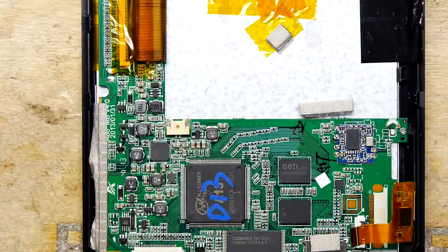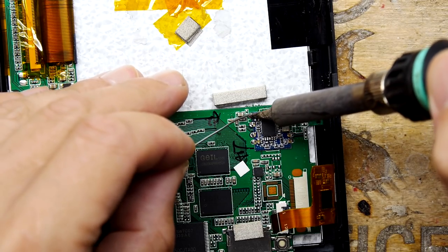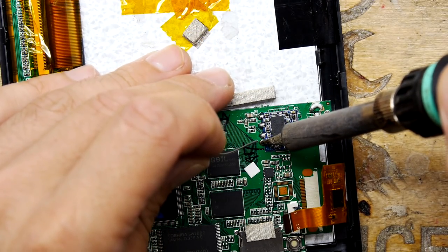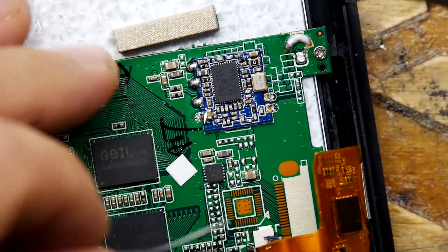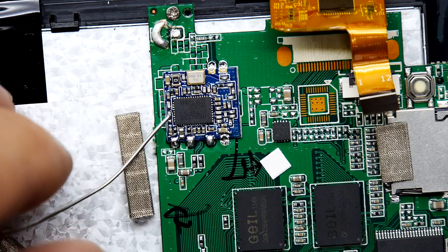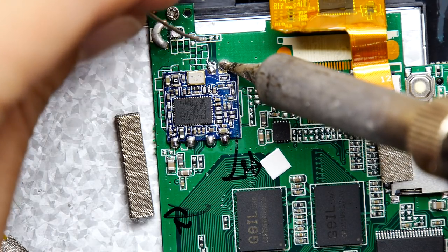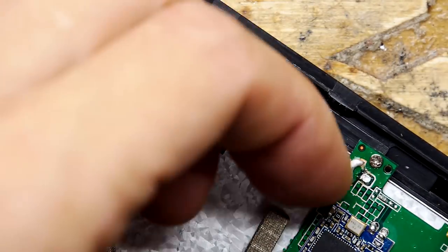I want to see if we can lift this module. I was going to use hot air — I've already put a blob of solder on the component. Okay Andrew, calm down, let's not rush. What I'm doing is just trying to re-solder the pads. The main reason is I'm using leaded solder and they normally use unleaded on the board, so I'm just trying to mix and make a new alloy so it'll flow a bit better. I'm going to put a little bit of pressure on this corner of the board so I can try to lift it when I heat these two.